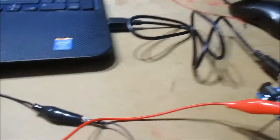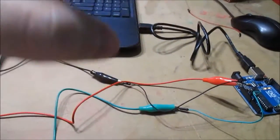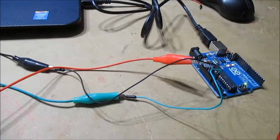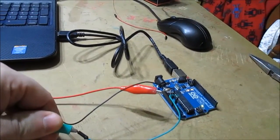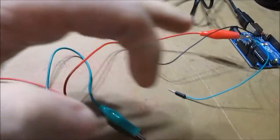Now let me show what happens if I lose my signal wire. This demo may not behave perfectly since there's no pull-down resistor built in, but normally they'll have a pull-down resistor so an open signal wire reads a steady zero. On this setup — signal wire open — just as I guessed, the voltage is jumping all over the place, erratic and bouncing. That's an open signal wire.